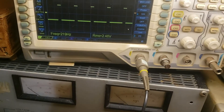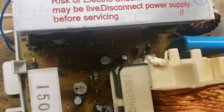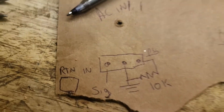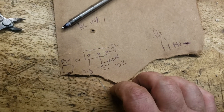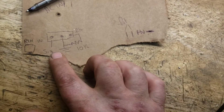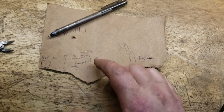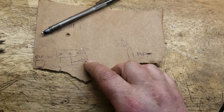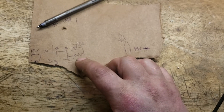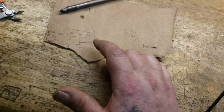If you start on a really small duty cycle it'll start fine. The way I do it is: just apply power to the AC connections, which are here on the board, and then apply your signal afterwards. The signal is a 5-volt square wave with ground, and there's also a feedback connection. You can't just leave this floating because the board knows and it'll assume it's got a loose connection and turn off. What you have to do is ground the feedback through a 10k resistor, and then the board is happy — it still thinks it's connected to the microwave and everything is fine.